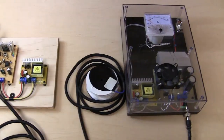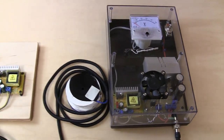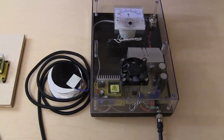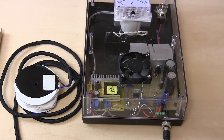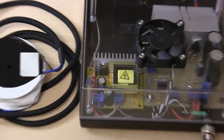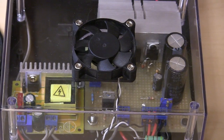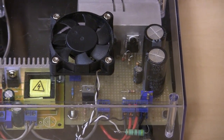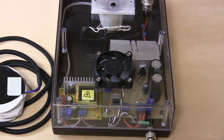I don't know if you're familiar with it, but this was the old magnetic pulsar that I made about three years ago. I invented a circuit for it and I've been giving the circuit away for free. It's a magnetic pulsar circuit — just a series of three different SCRs and then a MOSFET and they all work together. It creates a neat automatic circuit that triggers based on voltage. On the left there's a small voltage generator, and when the voltage reaches about 375 volts it triggers the circuit. The two capacitors are stored up with 375 volts and then they dump into an SCR, which is just a hard switch that allows a very large current to flow through it all at once.